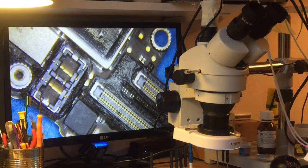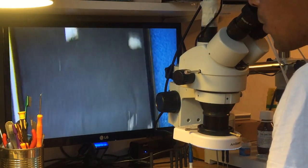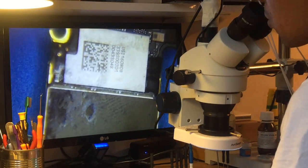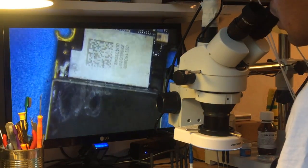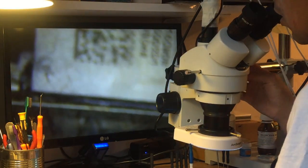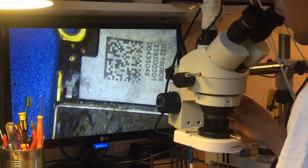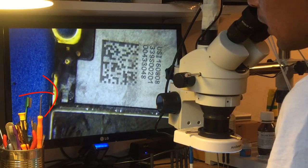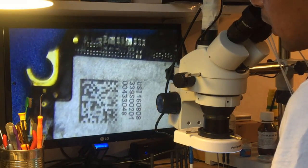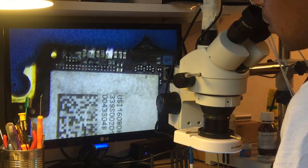In this case we have to take some time visually inspecting our board and taking off all the shields. The most important thing is that there is a main short here in the VCC main that we can see really clearly. I don't like cleaning the board with any materials because when you clean the board you lose track of the damaged components.